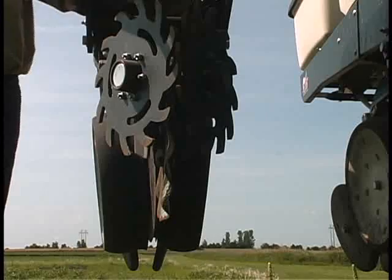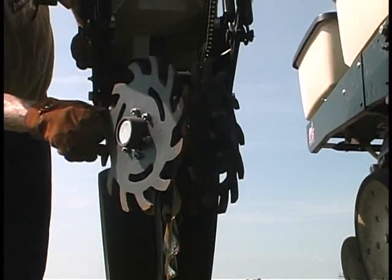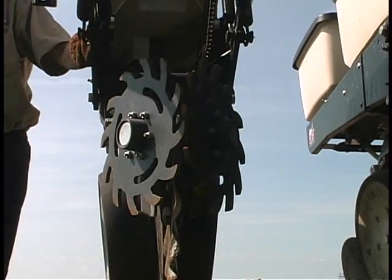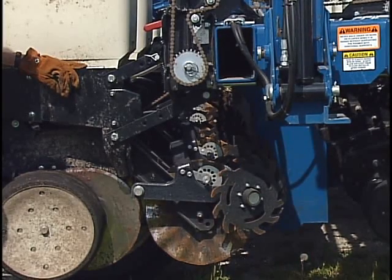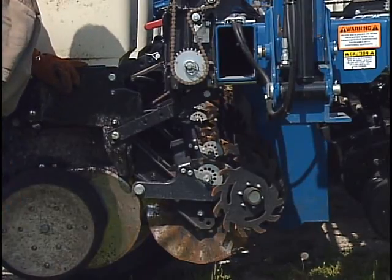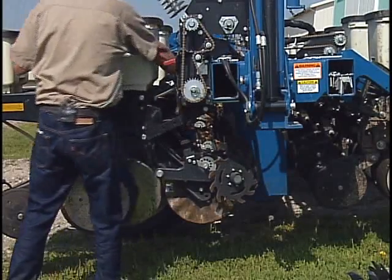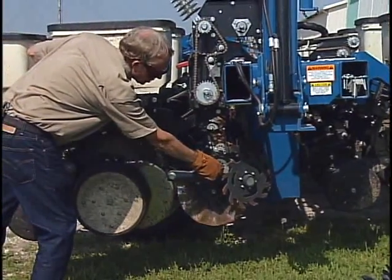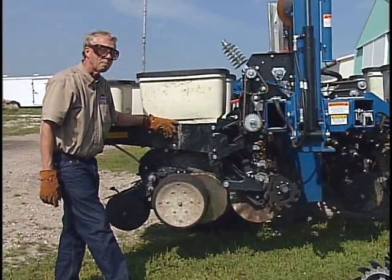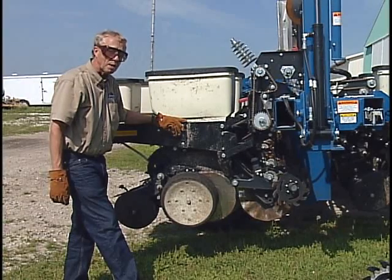On this particular planter, we've got a set of finger wheel row cleaners. You can see they're in the interlocking position — you can mount those so the fingers interlock or not; there are advocates either way. This is a set of floating row cleaners that float with the ground surface and pivot, with a cam and spring adjustment to set that height. Height adjustment on the row cleaners is the key component. You want those row cleaners turning some of the time, but probably not all of the time.